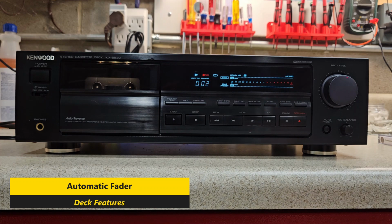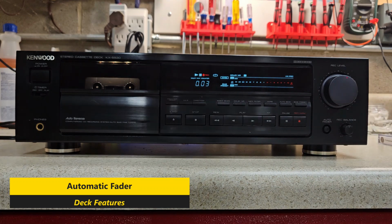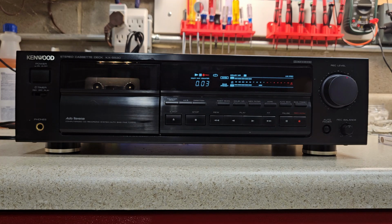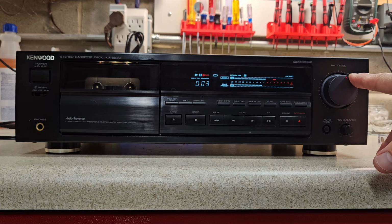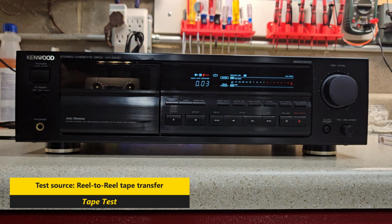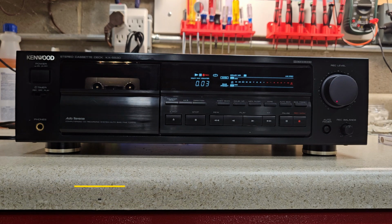by putting it into record mode, pausing it, and then listening to whatever the source is that you want to use. This is a source that I use every now and again just for fun when I am testing. So you can set your meter or set your record volume the way you want it. I'm getting up to a +2. So you can get your recording ready to go. And then what you can do is start that recording. Now notice I have it on pause right now.